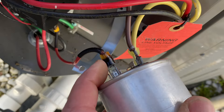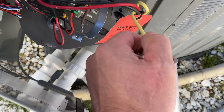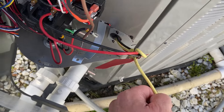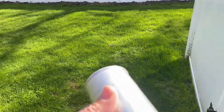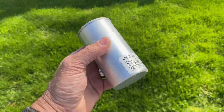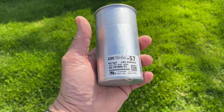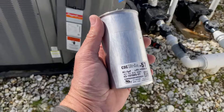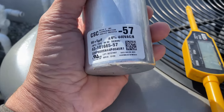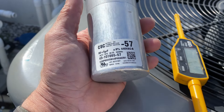I removed that wire and that is definitely not factory. Let's take off the rest of the wiring — brown being our fan. She fails the shake test — listen to this. You hear that swishing around in there? Factory there was no noise coming from this capacitor. It failed the shake test and also failed dynamic testing while the system was running. It's assembled in Mexico.